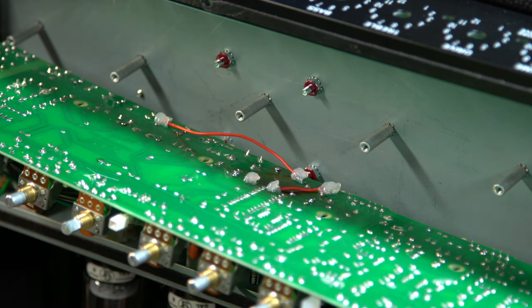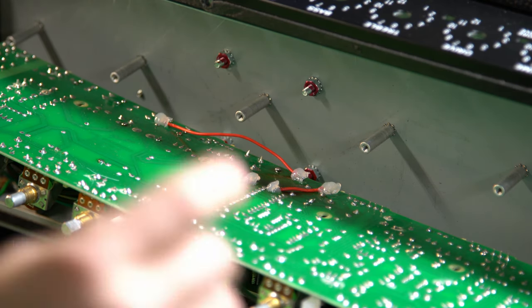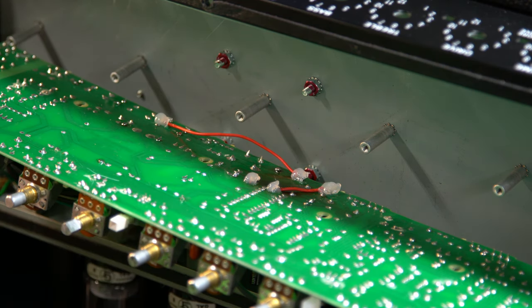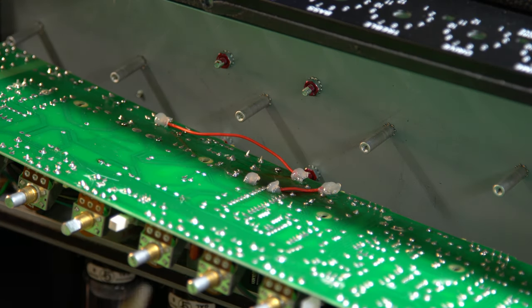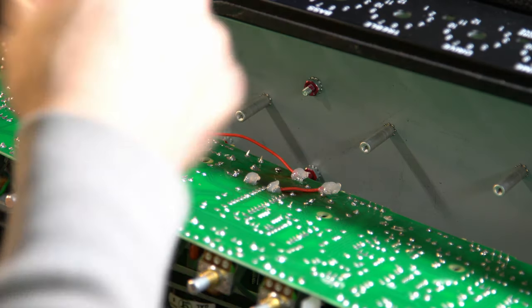That's the typical kind of approach — I'm not as good as some guys who might actually repair damaged solder pads, but I was able to get that all together. I forgot to film it and started putting it back together to test, and found out that the channel switching wouldn't work — everything else was working but channel switching wouldn't. That was because one of the solder connections on this jumper was broken between there and a trace. I scratched away a little bit more of that trace so I could see it, made the solder connection between the trace and the connections there, and it seems to be working. If that doesn't work, I may have to remove the silicone and do another jumper, but we'll get to that.